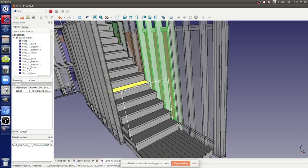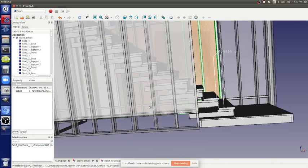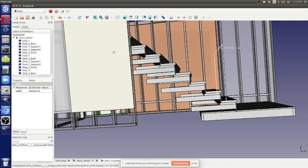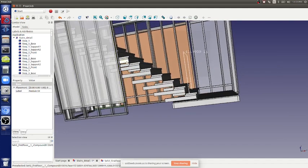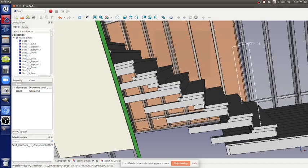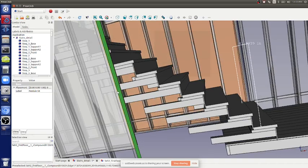But it is critical that we get the adherence into the two-bys rather than into just the panels, for those areas. Yes, exactly. For the structure of this, where you're walking up for many years, you're screwing these long members into the framing. It's not just the plywood. Use long screws, and they have to go into the framing members, not just in between. The plywood's not going to hold much.